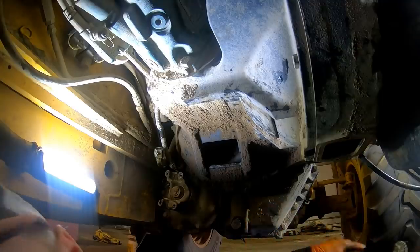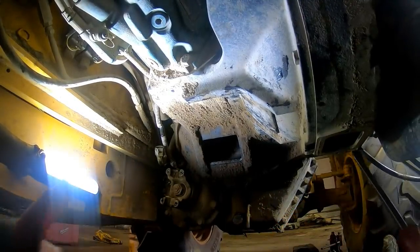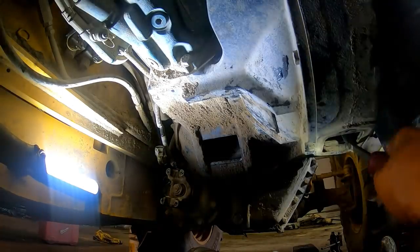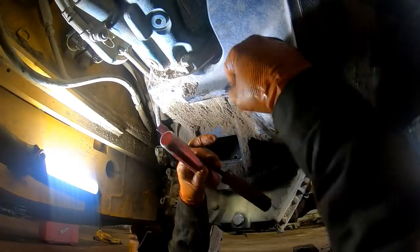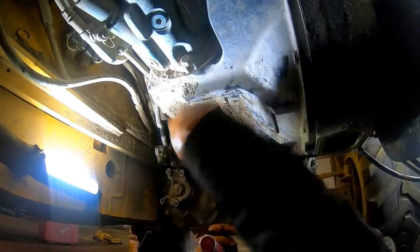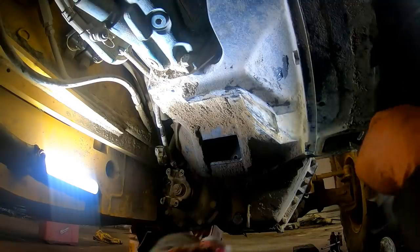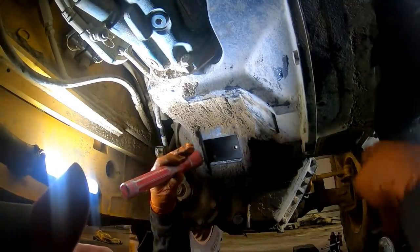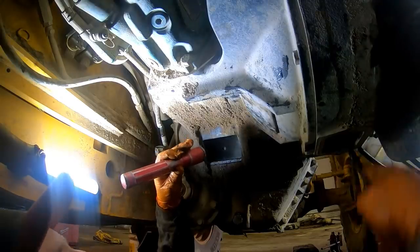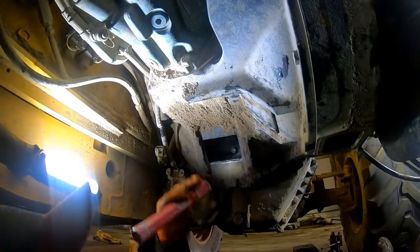Down here, though. Okay. Got the inspection plate. This has got what they call a bevel gearbox on it. So the flywheel comes out, and there's a couple bevel gears that mesh with each other, and that's how you change the 90 degree offset of the engine and transmission and how they rotate. So I got the little plate off here, and I'm just on the ring gear with a little bar, just rotating it around to the next hole.